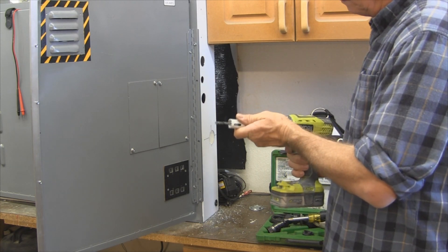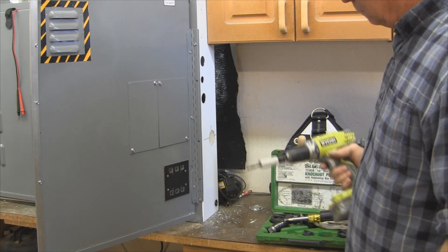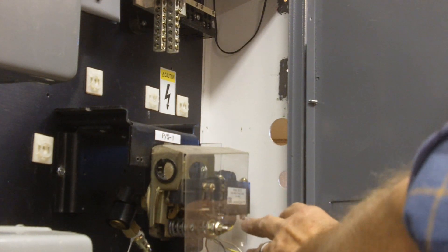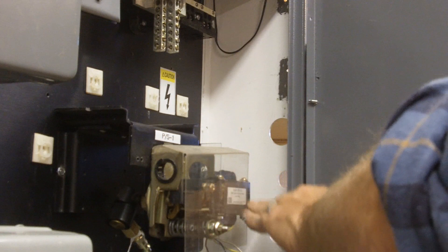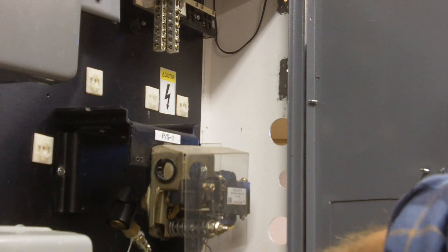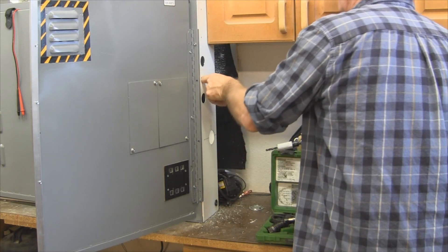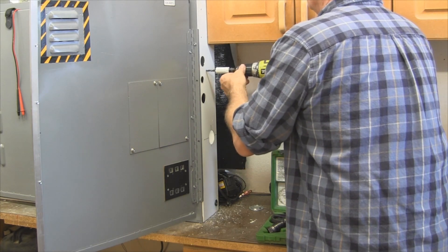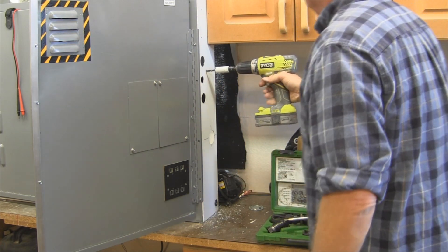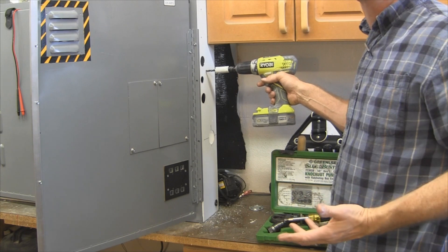You want to keep in mind again what's on the other side of that — is it wiring? In my case here I've got stuff in here, so I'm going to want to make sure that when I drill through, my bit — being as long as it is — doesn't hit anything, any wiring, or the transformer that's back there. I can actually see the transformer through there, so I'm going to drill it right about here. And I don't know how sharp this quarter-inch bit is, so we'll go ahead and drill it and find out.